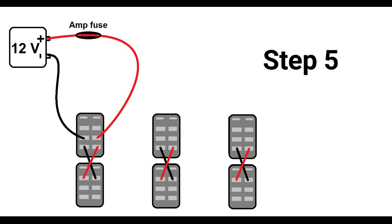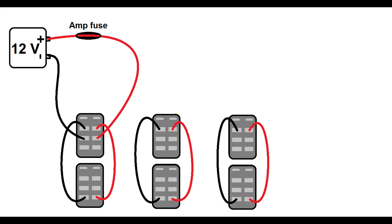Step 5: Connect the forward and diving relays with the backward and surfacing relays by crisscrossing the polarity, just as before. Make sure you attach the wires exactly as shown — this way power flows to the second relay whenever the first relay is turned off. Step 6: Connect the relays in this constellation so power flows straight to the ROV from the activated first relay through the switched-off second relay. Activating both diving relays does not cause a short circuit — they just cancel each other out.